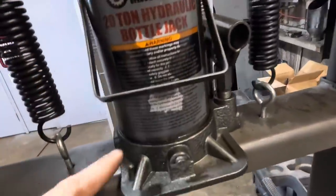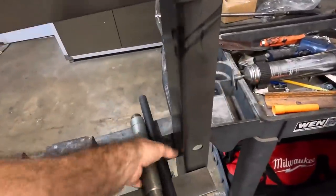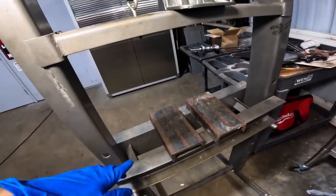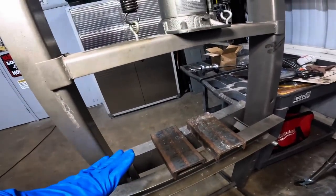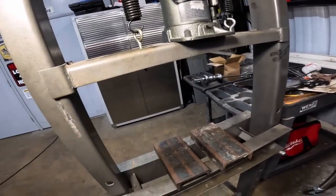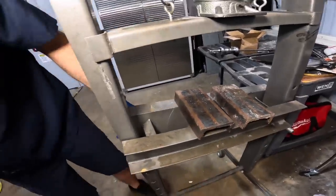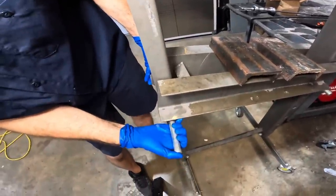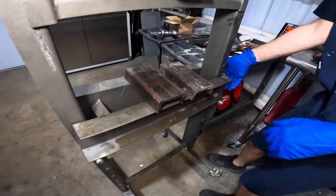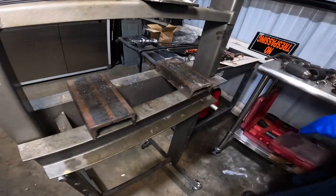This jack's leaking everywhere. I'll fill it up full with motor oil, and then it'll stop leaking — no big deal. First things first, I need to raise up the press surface on this press unit a little bit higher to the next notch. That way there's less space between the bottom of the jack and the top of the surface. All we need to do is pick this up, pull the pin, move it up to the next hole, set it down, switch sides, and raise the other pin up.